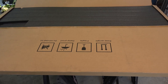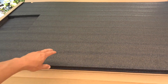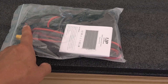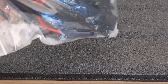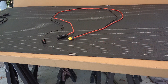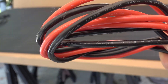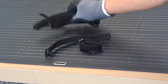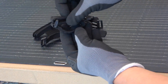This is the cardboard box the solar panel comes with. Inside you get two pieces of foam, a package of MC4 connector to XT60 cable adapter, a user manual, and velcro straps. The adapter cable is about 60 inches long and it's made of silicone rubber, so it can take a lot of heat, and it is size 12. It comes with 8 velcro straps for mounting.